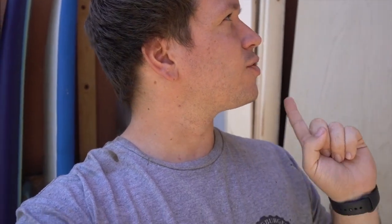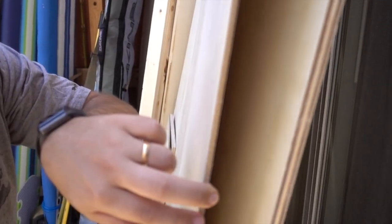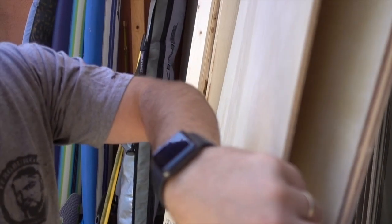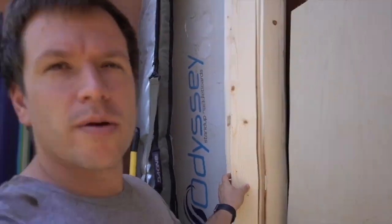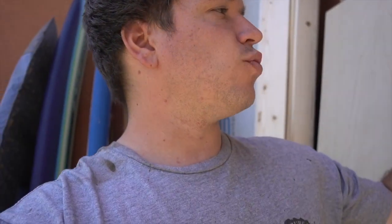I'm outside. I just wanted to give you guys a basic idea of the lumber I bought. For the lid, I got this really thin plywood — it's only five millimeters. For the base, I got half-inch plywood. I'm going to mostly be using these 1x4s to make the frame. I also got a few 1x2s for the roof where the frame's going to be a little bit less thick. My max width is 48 inches because that's the width of the plywood, and the length is going to be roughly 80 inches. First, I'm going to start making the base.